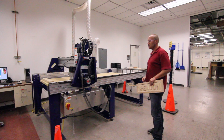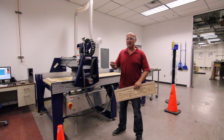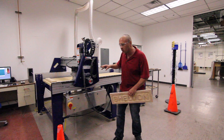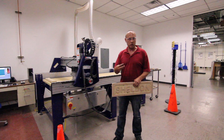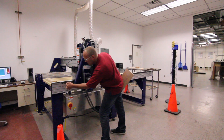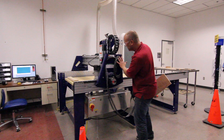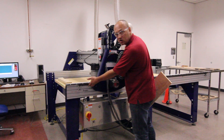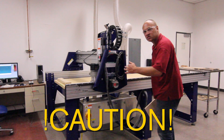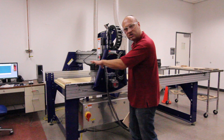Behind me is the ShopBot. Probably of all the machines we have in our lab, this is the most dangerous. I don't want to use that word to scare anyone — it's just something that is computer-controlled with a motor that can grab you if you're not careful or smart. If you look at the ShopBot, you can see right here there's a rack and pinion, and this carriage moves back and forth. This is the area where you could get your hand caught. When you come to use this, we'll have it marked off so you can't reach in there. Just so you understand, reaching or grabbing over like that is a no-no.